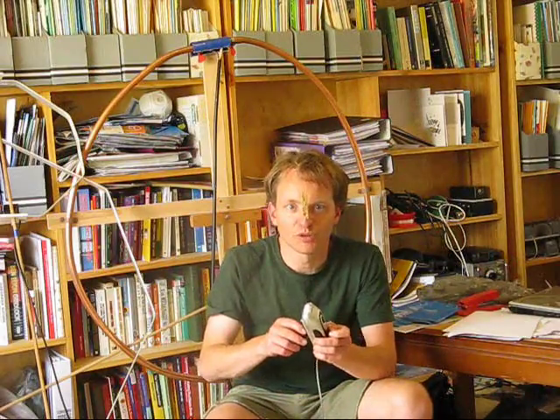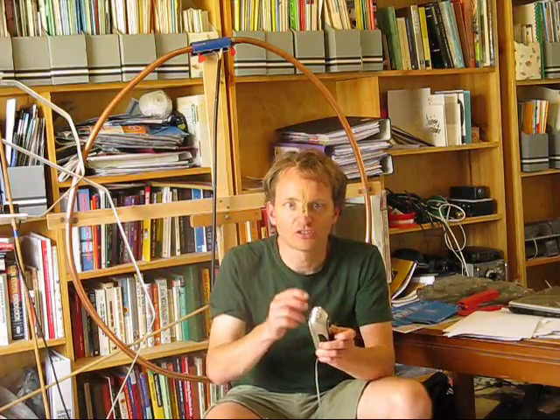After that cooking experiment, this place stinks — time to open some windows. But the experiment was successful: you could generate appreciable amounts of current with the generator in a cheap wind-up torch. Going back to the calculations, 6 volts across 12 ohms is half an amp — 500 milliamps. Not bad for a cheap little toy. In practice, though, you probably wouldn't be cranking that vigorously, and the real amount of power something like this could put out would be more in the range of 100 to 300 milliamps. Still, that's useful to power other things.